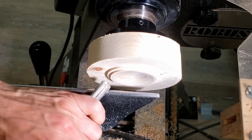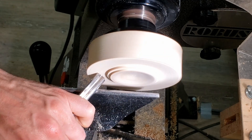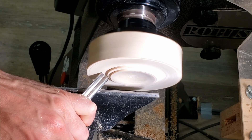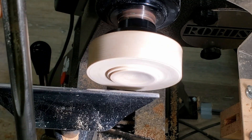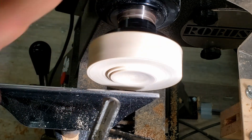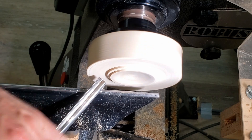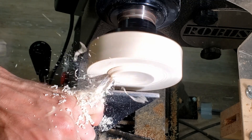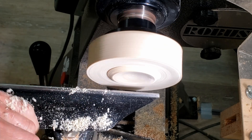I'll demonstrate what happens if you try to just go straight in — it's not great. I'm not making any cut over here, and as I'm touching this first lip, the part that's touching is either the center or even the right-hand wing, neither of which have bevel support against the work. So that's going to be either an uncontrolled cut of low quality, or it just might be a catch. And indeed — I engaged a lot of the cutting edge there all at once and it didn't like it. No good.